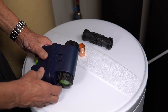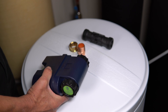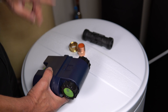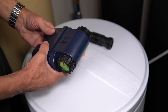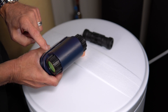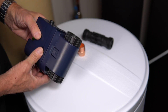Once you've got your fittings, the next step is to cut the pipe. Make the first cut, putting a bucket underneath to catch water. Once you've made your first cut, determine the distance for the second cut to allow the system to be installed. The unit has a flow direction arrow on it, so be careful to install it the correct way. In our case, the water flows up, so ours is installed with the arrow pointing up.